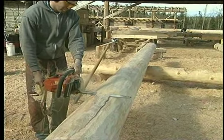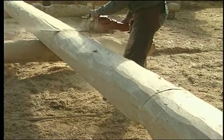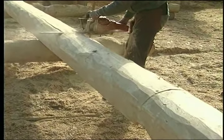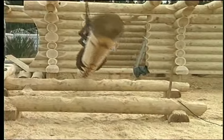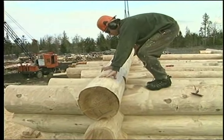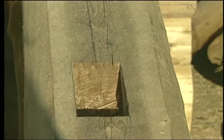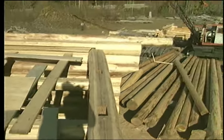If this or any flat cut is to stop part way, make the end cuts first to avoid over cutting. Replace the cap log on the building and start work on the ridge and purlins. You might cut the cap log mortises on the ground.